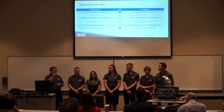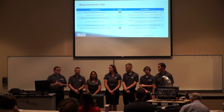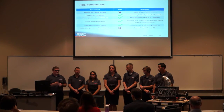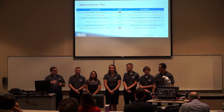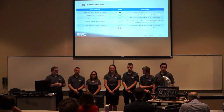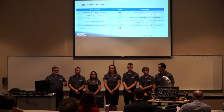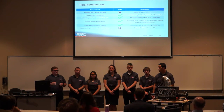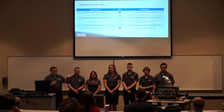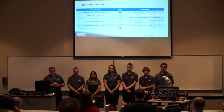The side of combustion in this project is that we designed an awesome heat exchanger, but uniform temperature distribution just doesn't normally happen. We designed the burners so things could be changed out. Going forward, we'd like to see what changes with different fuel pressures and different compressor manifold pressures — which we didn't want to experiment with heavily given our PVC manifold. We'd also like to try different burner tubes. There was CFD analysis on hole sizing, and we got good distribution when we made different hole sizes, but the fabrication lead time was too long. We went with our current design as it was close enough to start testing. Here's how we move forward, whether that's another team picking it up or a customer taking it back to finish.